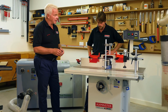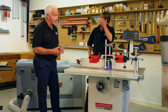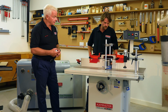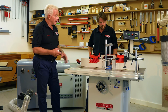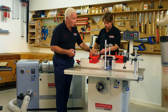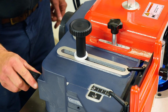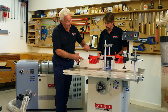The bottom speed is used for sanding, so at 1400 RPM, if you've got a drum sander you want to put on there, that can be easily accommodated. Setting the machine is very straightforward, nothing complicated, but what I do like is the very solid aluminium horseshoe guard here. Everything's fully adjustable. You've got independently adjustable fences there with 40mm of offset between each fence.